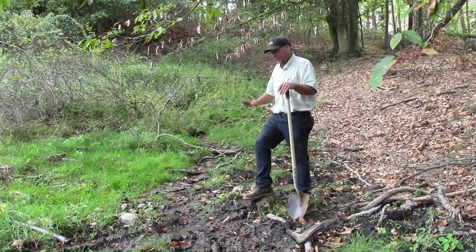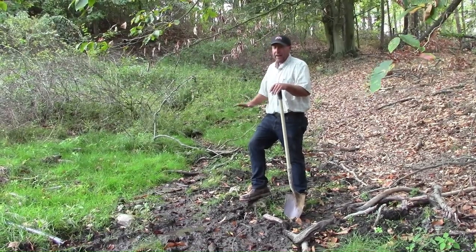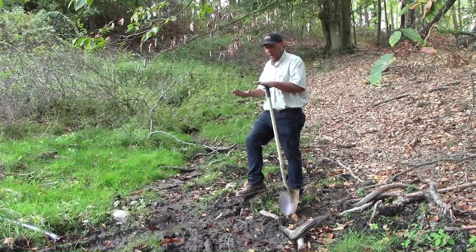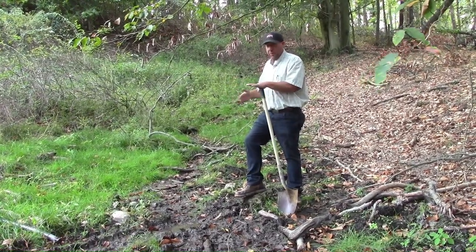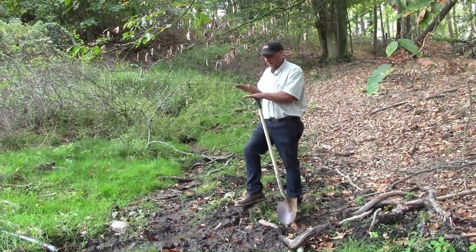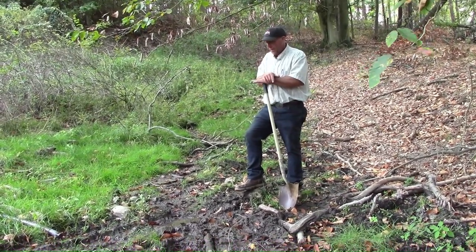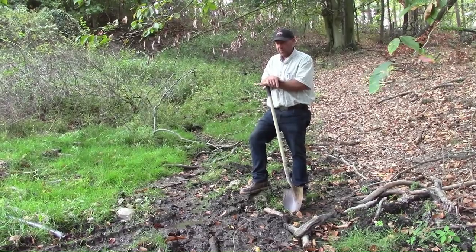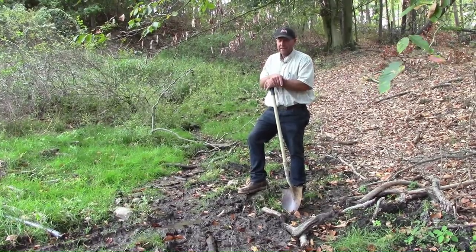I'll sprinkle some dirt on it, then put the pipe in the dirt, pack it down with my feet, and then continue to put layers of dirt on top of it — hopefully getting it wet because we need that dirt to be just a little bit wet to tamp and stay in there. At that point we'll have a dike and a small water catchment that will push the water through the pipe. We need to build that dike up just a little bit above the pipe and also give it a route around in case we get one of those big thunderstorms we're all hoping we get. That water will come screaming down through here and take out our temporary dike, so we need to give it a way to go around it. Know that if we get a storm you may have to come down here and do some maintenance — that's why this is a temporary thing.